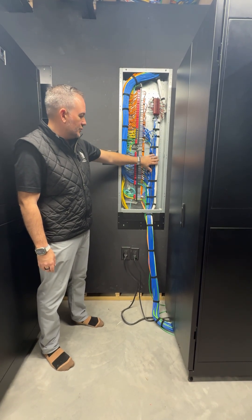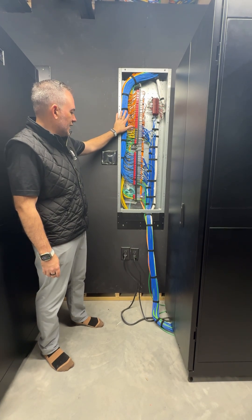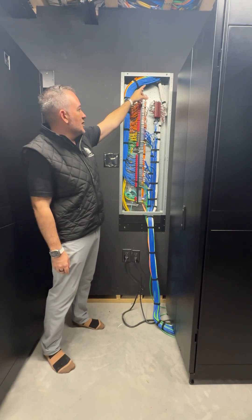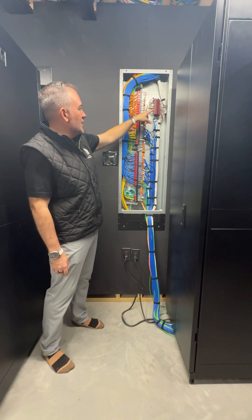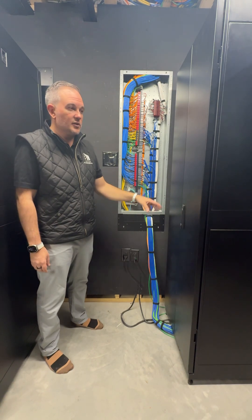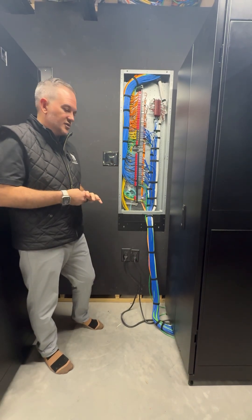We velcro the wire to make sure it's secured and not going to get pulled out. Along with the CAT6 cable, we also have our 14-gauge speaker wire coming into this termination block. The wire comes in one side and then comes out the other side — that feeds down into the amplifiers, while the other side goes up into the ceiling and over to the speakers.